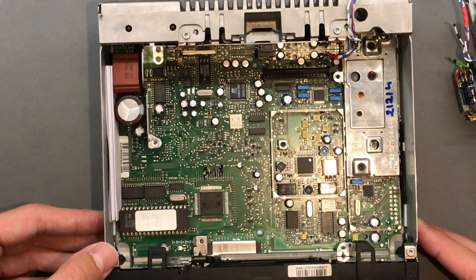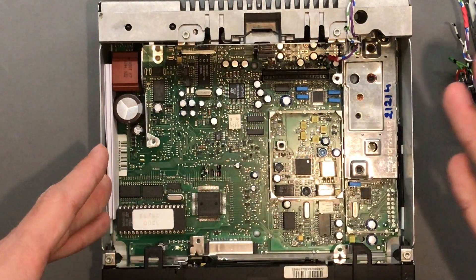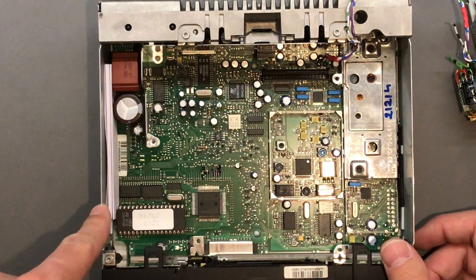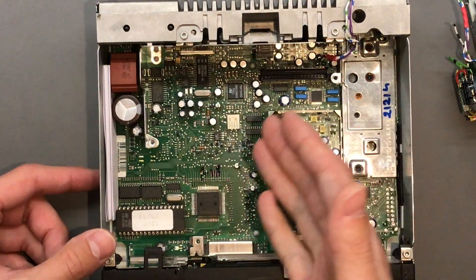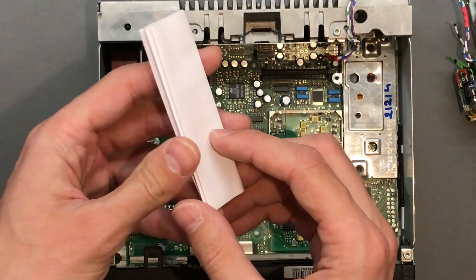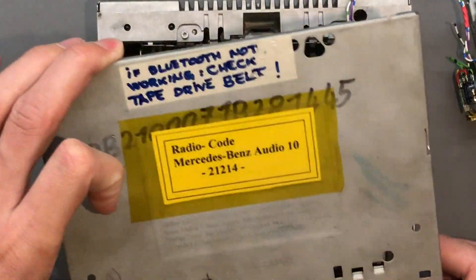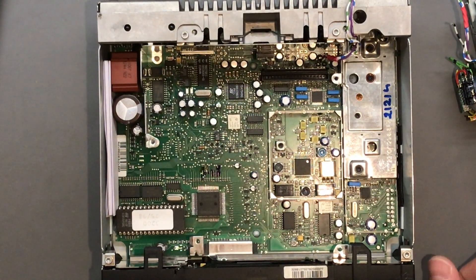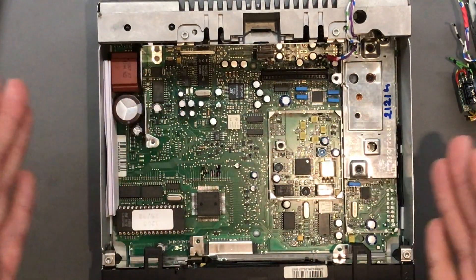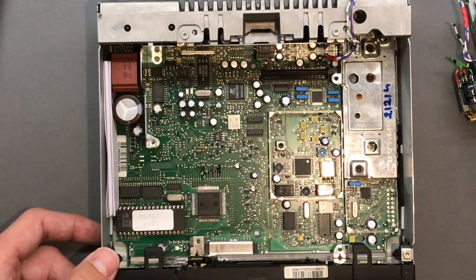I think that pretty much covers everything. You connect to those three pins on the BE3200 — the 3100 and 3200 should have very similar topologies, and I'll include all the datasheets I have. The tape mechanism can't easily be spoofed, so you're kind of stuck with it — which is why I put a little note inside instructing any future repairman on what to do if the Bluetooth doesn't work. Let me know in the comments if you have radios like this, and if yours has the fader — let me know why mine doesn't. Any other questions, as always, down in the comments. Have a good one, guys.